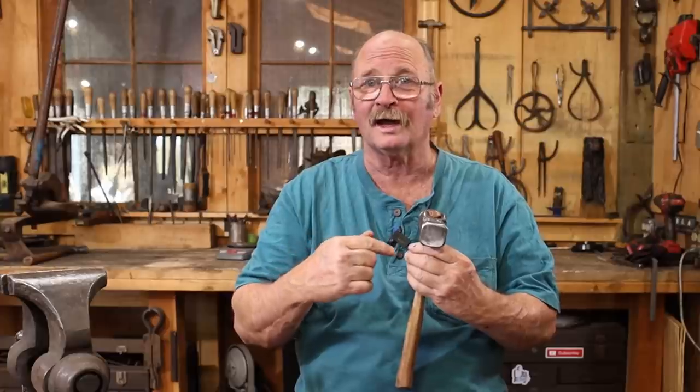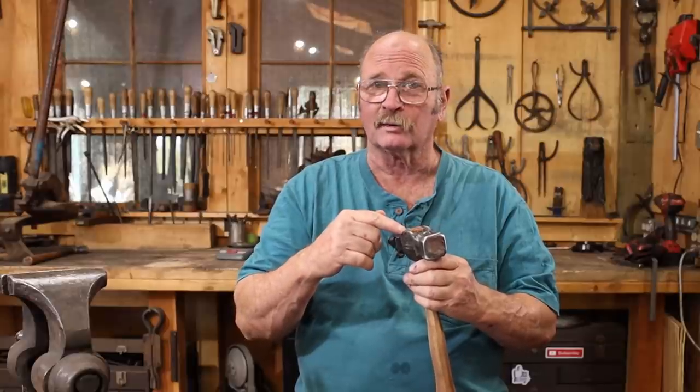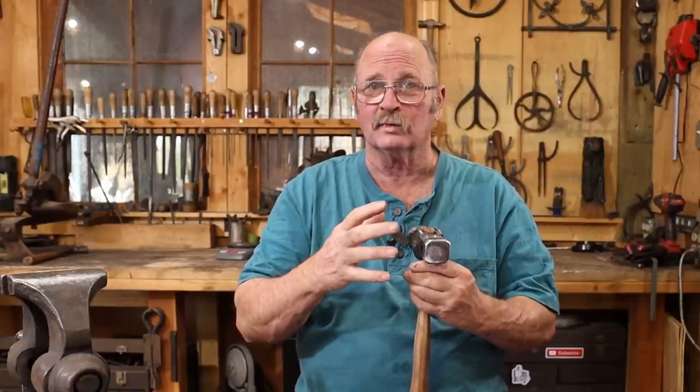That worked real well, and if you're making a lot of hammers, a hydraulic press with special dies for each step is really useful. I found I don't really like punching eyes under the hydraulic press. I like the control under the power hammer better because it takes a little longer and you can stop between blows much easier than with the press, which usually by the time you realize you're off a little bit, it's too late to fix it.